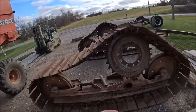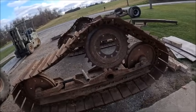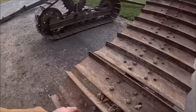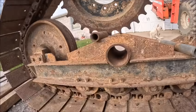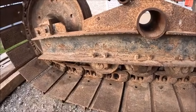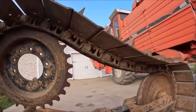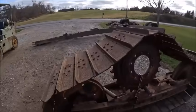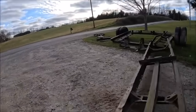Tracks are here. There's almost nine feet overall — actually it's nine feet overall, like seven and a half feet of pad on the ground. It ought to not sink anymore. 20 or 24 inch grousers. Sprockets are good, rails are good. I did notice there's a couple loose cleats but nothing you wouldn't expect out of a set of four-year-old combine tracks that have been around for a minute.